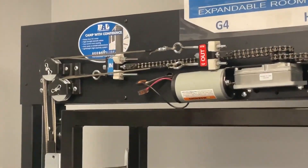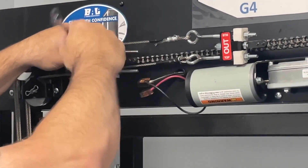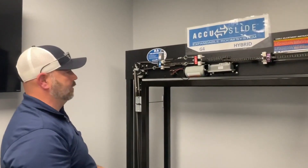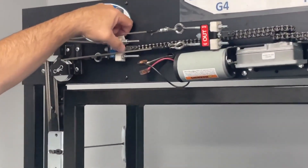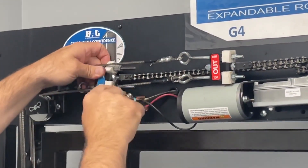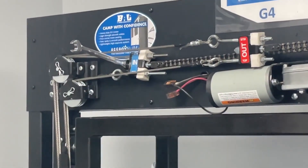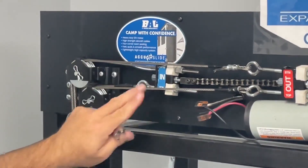Go to your in on the left hand side. Take up your slack on it evenly again on the chain. Get a half inch up, half inch down on the cable on the outside. You don't have to go outside the coach to check this — bottom and top are doing the same thing: half inch up, half inch down, no droop or sag. Run your jam nut tight to your adjustment bracket using an open-end wrench. If it's getting stuck on you, tighten it up and smash it together on the back side. Make sure your chain's nice and uniform — hand on those pliers, grab the chain, pull down, pull the bracket to it, and straighten everything out.